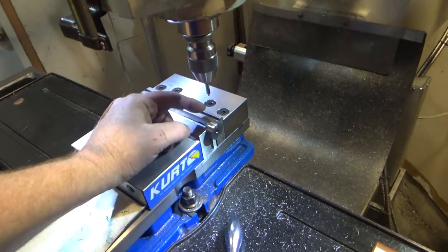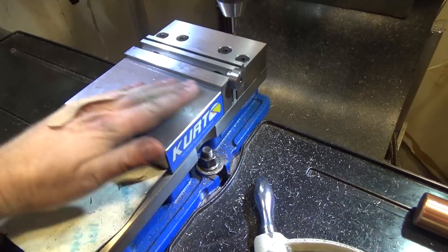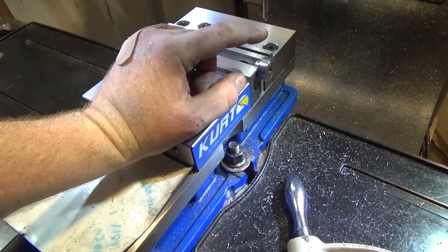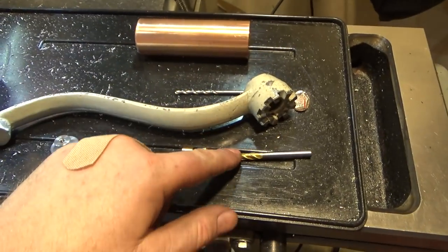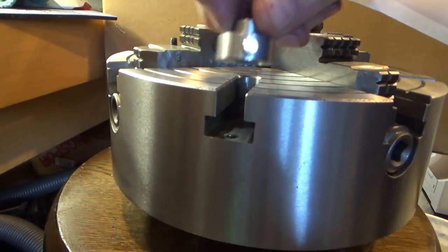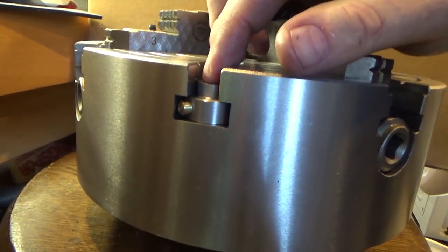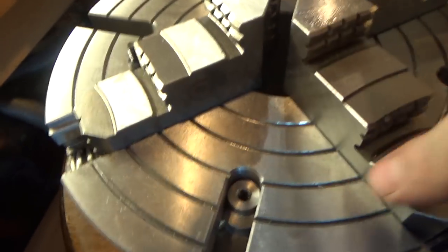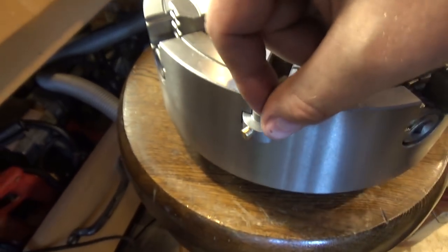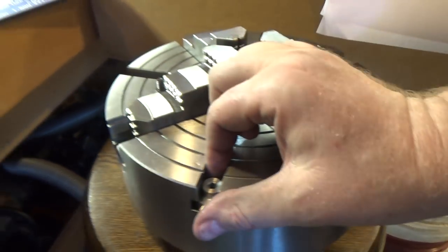I don't have a great work holding situation here. I should have left some extra material if I was going to plan ahead for this, but since I didn't, I've got the vise cranked down really hard. And I'm walking up sizes to what's finally going to be a quarter inch end mill so I can get a flat bottom. So to give you a general idea of what they're going to do is these round guys can now fit in here, but they can't rotate, so you'll be able to untighten them. But they do fit all the way into the slot in the corner, which will allow me to get closer into the middle with my height adjusters. So that gives me advantage because the square one stopped early.